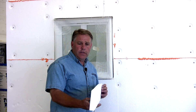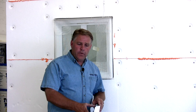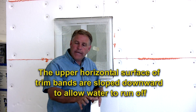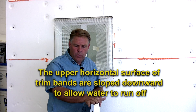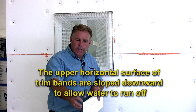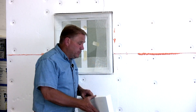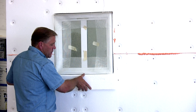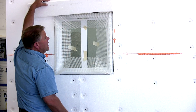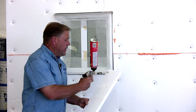Anytime we have anything running in a horizontal fashion, we want to make sure that we have a water table on this. What this is is a slope on top so the water — any type of moisture — anything that hits the wall will come down and run off the top of it so it won't pond. This needs to be close to about a 12-degree angle. It's put on the bottom or the base of any window and also at the top of any window so the moisture goes down and rolls off the wall.